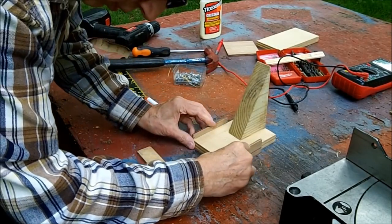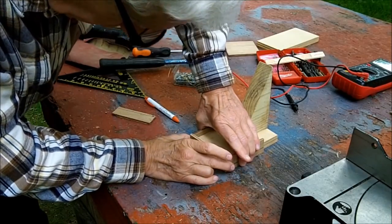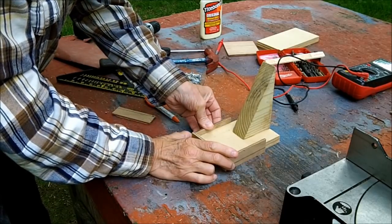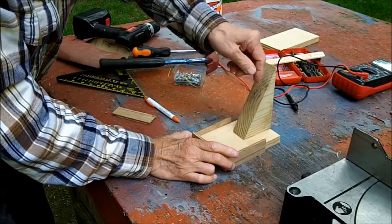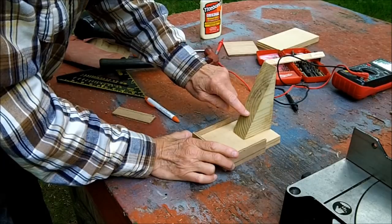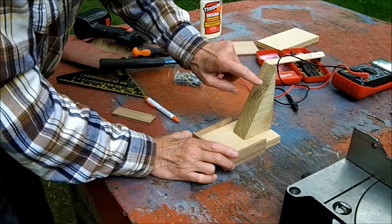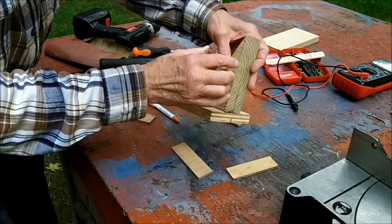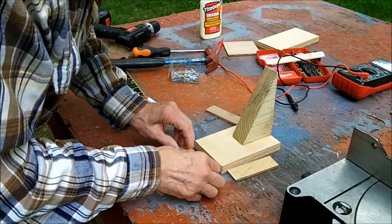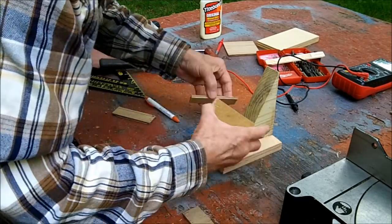What I've got to do here is put these three sides on like this. I've got to glue and nail these on first, and then slide the back in and glue that. I'll tack it to this probably with a couple of small brads — I don't want to screw into here because you'll split this wood. So we'll take some small brads. This is the front because it's a little longer than the others, and these are the sides.